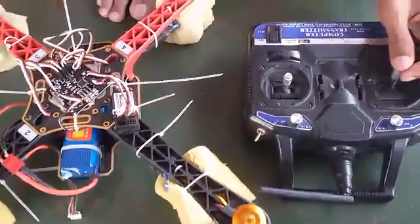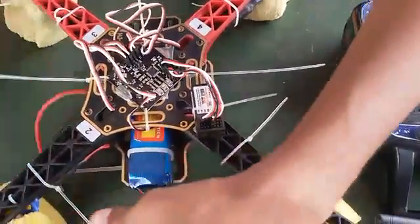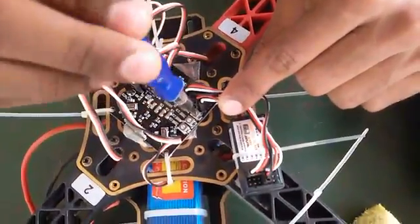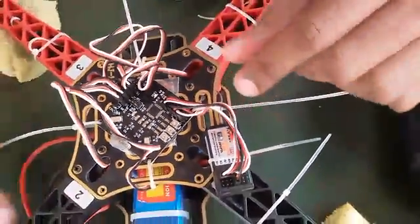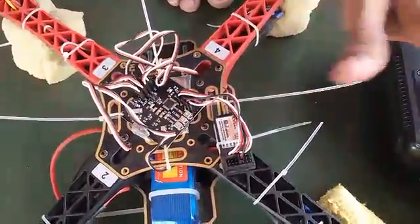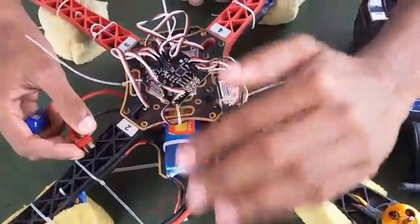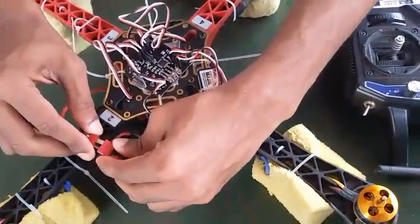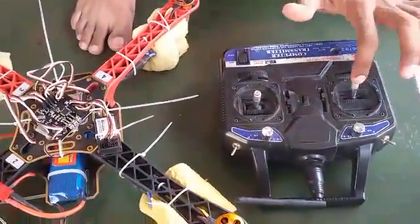This is board calibration. Unplug this, then maximize the yaw potentiometer — rotating clockwise, it's in maximum. Don't worry about pitch and roll, it will be whatever. No need to adjust those pitch and roll accelerometers; just yaw is enough. Then connect your battery.